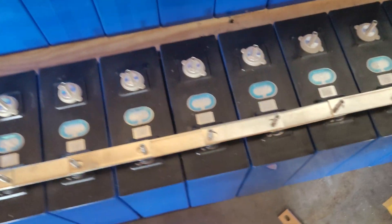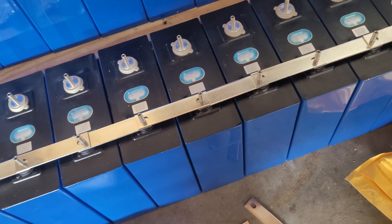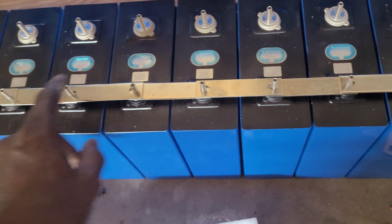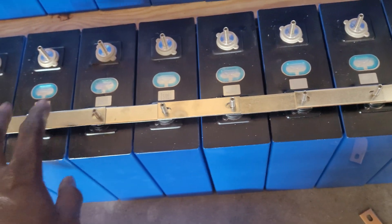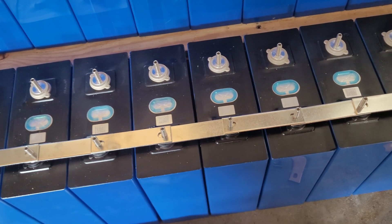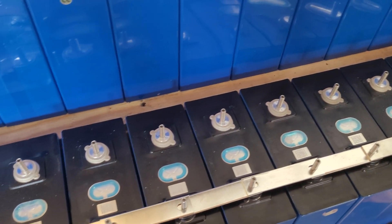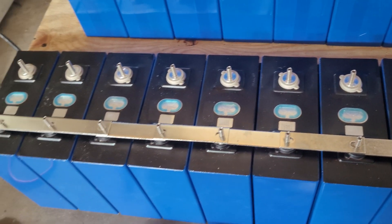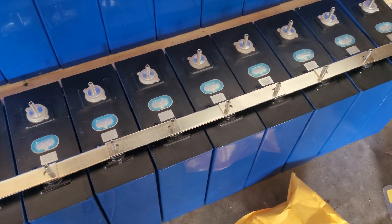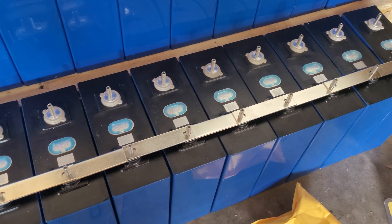You want to set that up — I see a lot of people normally wait about twenty-four hours, I know some guys that wait four hours. The bottom line is: put your multimeter on here and check for current running through any of these strings. If they have current running through and they're not zeroed, they're not finished balancing yet. Once you get zeros throughout each one of them, it's totally balanced and 100% ready to go. I'm going to go ahead and finish assembling these and then let them sit for a bit, and I'll give you guys an update a little bit later.